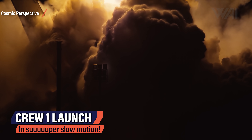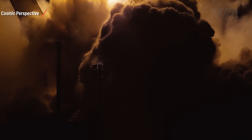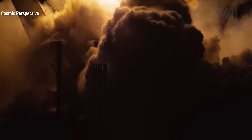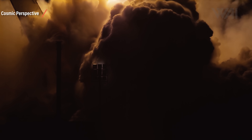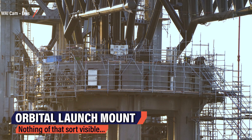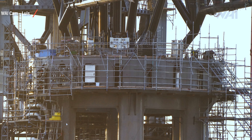One last mystery about the orbital launch mount remains — what about a flame diverter or sound suppression system? Anything that would mitigate the sound waves produced by 28 and later 33 Raptor engines igniting at once. Footage from the SpaceX Crew-1 launch shows wave-like deformations in the water vapor cloud — those are strong sound waves. The cloud comes from the deluge system, where water is used to dampen shockwaves. On the Starship orbital launch mount, nothing of that sort is visible, even though a Super Heavy booster will have more than double the thrust of a Saturn V.